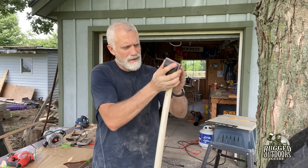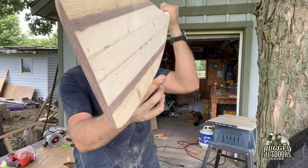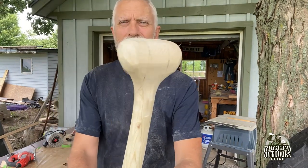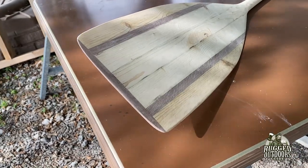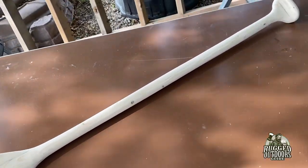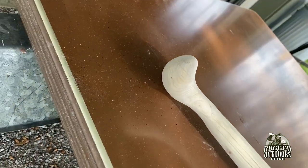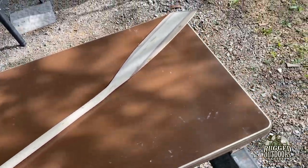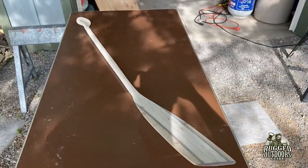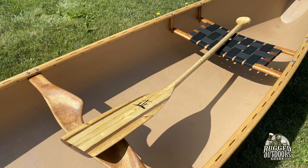I did some manual shaping around the handle with a sanding block using heavy grit. The blade is now pretty thin and looks ready to go. The grip was harder to do manually — I couldn't finish-sand it as well with a palm sander. I shaped the handle to be slightly oval for comfort, and the asymmetrical grip design came out really well. Then it was ready to be varnished: five coats of marine spar varnish. Your only challenge is avoiding drips and sags as it dries.